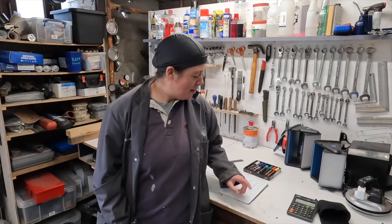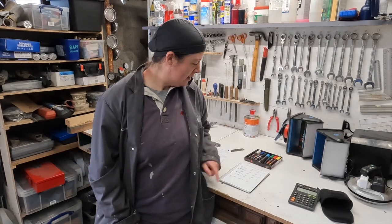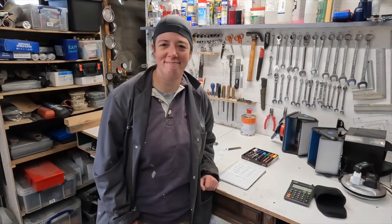We've unwrapped the windows and doors and had a quick look at them, and they all look absolutely fantastic. I've had a look in the installation manuals, and I've got the aperture sizes and wrote them down for each of them so we don't forget. The aperture sizes are the inside dimensions, which means we need to determine a cut list and add on the extra material for the 45 degree mitres. And that's what I've got down here. And I've left nice little space here so that you can tick them off when he cuts them.